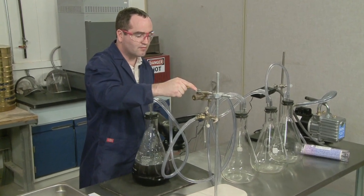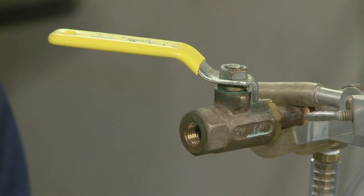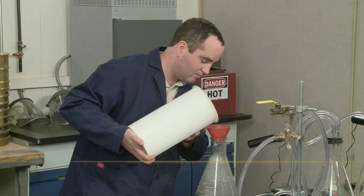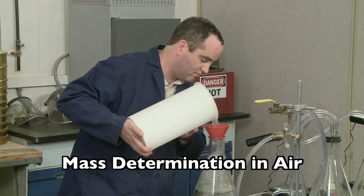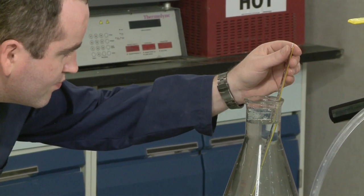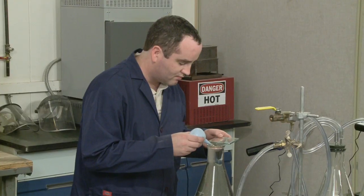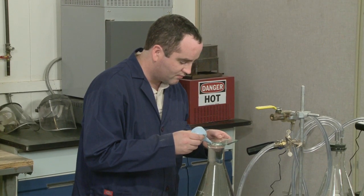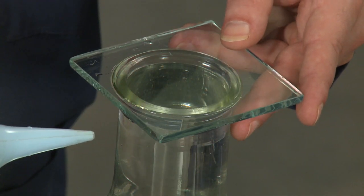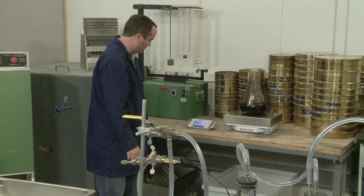At the end of the vacuum period, gradually release the vacuum at a rate not to exceed 60 millimeters mercury per second — that's 8 kilopascals per second — and proceed with the mass determination. We are demonstrating the mass determination in air. Fill the flask with water and bring the contents to a temperature of 77 plus or minus 2 degrees. Use the glass plate that was standardized with the flask to ensure accurate filling. Make sure no air bubbles are trapped beneath the glass plate. Wipe off all excess water and weigh the flask and contents.